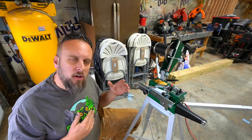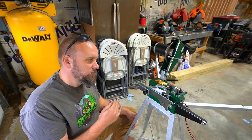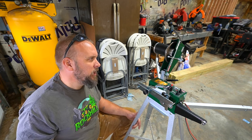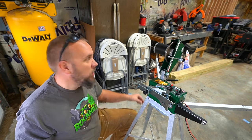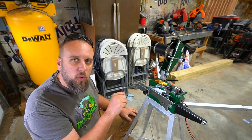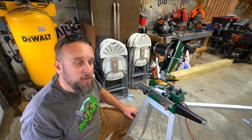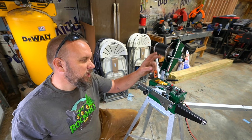Now, if you've watched videos on the standard Woodland Mills sharpener, the advantages to this, one is a speed advantage, that it's got that high speed setting and you can sharpen a blade over twice as fast. Now, I think it's either 5 or 7 minutes to sharpen a blade. Additionally, they had an abrasive wheel that was more like your standard wheel on like this bench grinder over here, and that would wear down as it sharpened, and then you would have to kind of square the wheel up or reshape it with a little tool. This is a diamond wheel that's going to last a long time. So that's a big upgrade. There are some other things, but the two biggest things that stood out to me were the better design of the wheel and the speed.